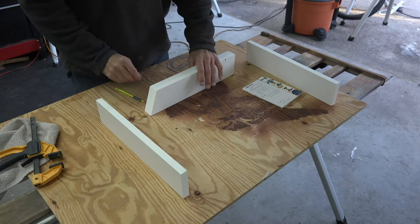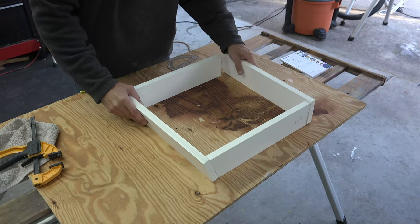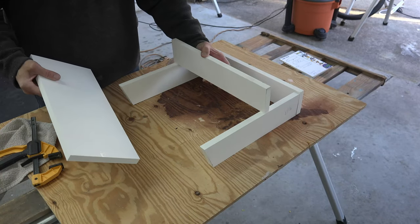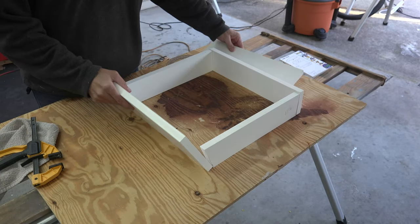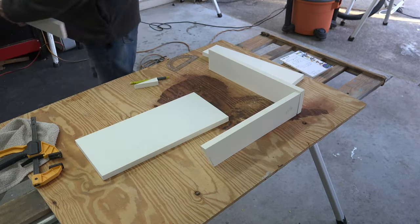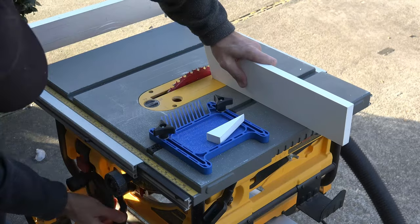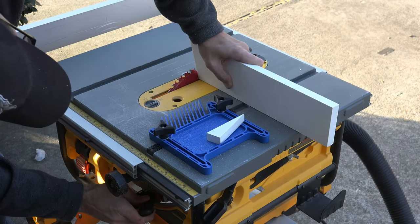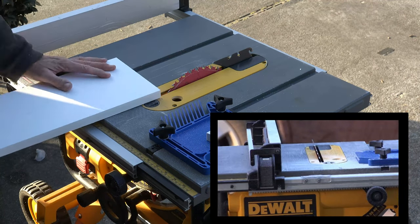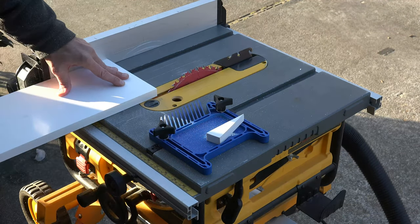When I took the ends back to align them I saw my error — the end piece would need an angle cut so it would be flat on the bottom piece. This angle would actually cause the board to be shorter than the end pieces. To save this piece I will use it as the cross support piece that will reinforce the box when it's used as a step. I will simply recut the end piece from a new piece of PVC. Since I randomly made an angle for the end, it would be quicker to align the blade with the already cut ends instead of using a protractor. Once set, I cut the bottom of the piece, which will allow it to sit flush on the base.